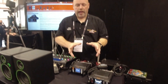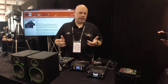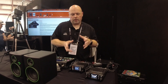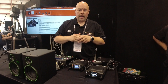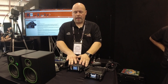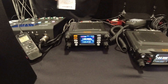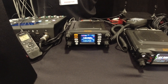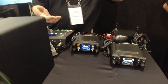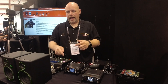So here we have one of the biggest debates: what is really the difference between the FTM-300 and the FTM-200? There are differences, and that's the biggest thing. At the top level, the 300 has dual receive on two bands — it's a true dual receiver. So if you're into satellites or any of that fun stuff, you can do the split on there. In addition, you can run Fusion on the A or the B band.